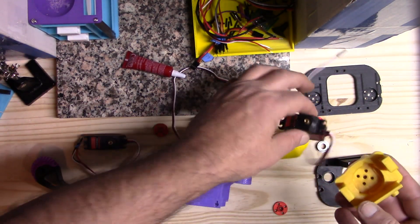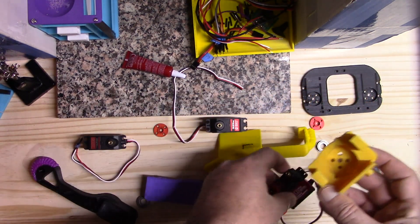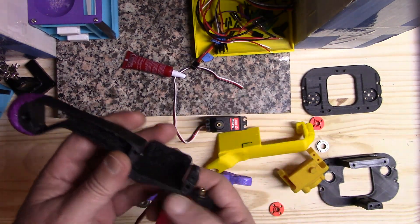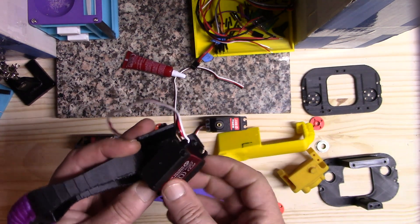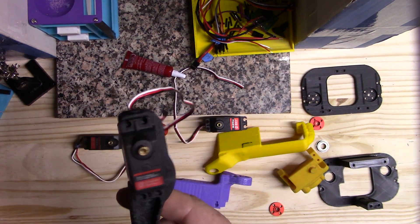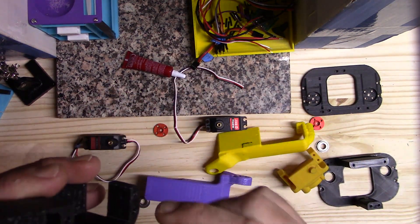Let's see how quickly we can mock this together — I won't fully assemble it, but I'll give you the idea. The first thing you do is install your motors, starting at the wrist piece. Put a motor in like this — the wires will always point upwards towards the body — and screw it in place.